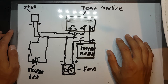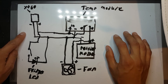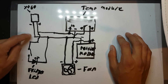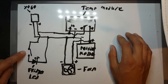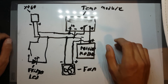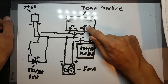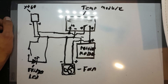This diagram indicates the operating principles of the fridge. Power enters via an XT60 connector, fairly common in the RC industry. Then power flows to a couple of separate circuits. Power flows through a normally closed switch — as in, when the lid is open and the switch is in its normal state — power flows through it to the fridge light. Aside from the fridge light, we have the cooling circuit. Power flows to the relay module in the lid, which activates the relay when the temperature is above a set limit. Power is then allowed to flow into the rear fan and the Peltier module. Fairly simple.